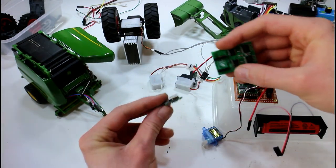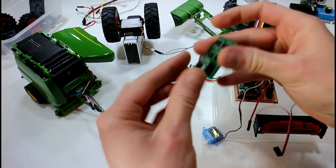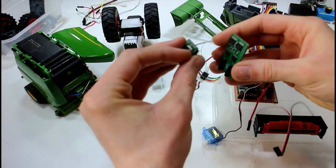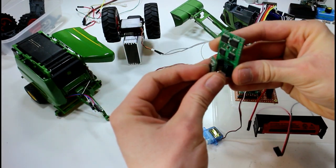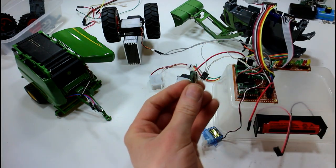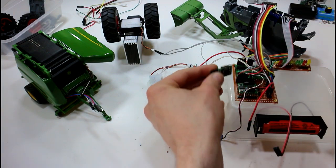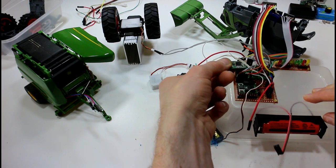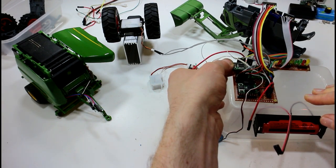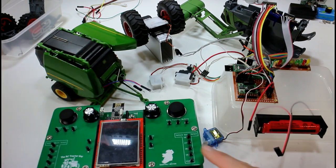The first thing we're going to do is hook the control chip onto our motor driver — it's only a matter of plugging it in. You can unplug it, go and program it, come back to your vehicle and just plug it back in. That's a lot easier than the other version where you had to get the programming wire into the vehicle somehow. Let's plug it into our test rig — we plug in our board, it's already programmed, and we're wired up to everything.